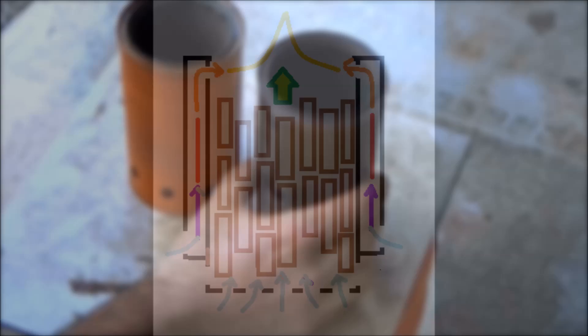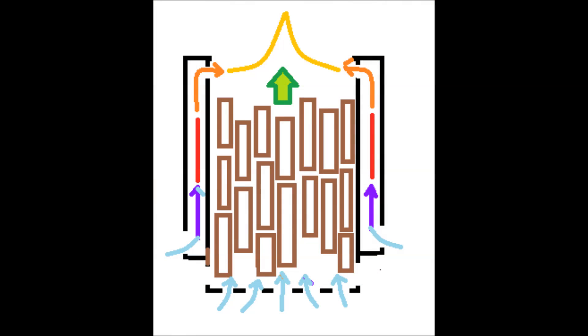In this picture you can see that the wood gas stays above the fuel. Fresh air comes in through the primary air ports and fresh air comes in through the secondary air ports after traveling along the inside of the outer can, where it is superheated before burning.